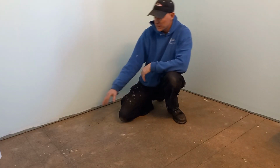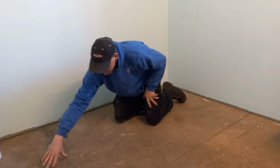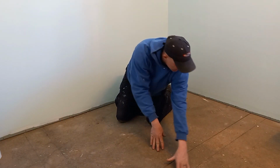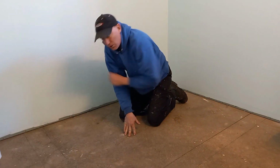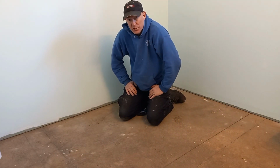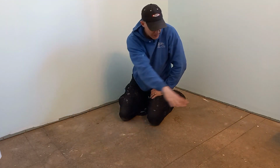We do have some pencil lines drawn out where we want our curb. We start here at the wall, come straight out, diagonally across right here, and then straight back to this wall. So we'll pour a curb 4 inches tall, which is what I figured I need, and 6 inches wide, right there on top of that pencil line.